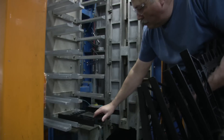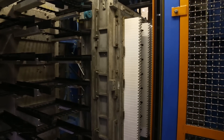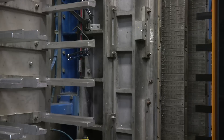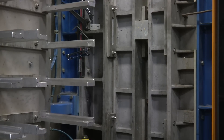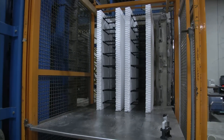The build block ICF webs are loaded into specially designed molds. The two pieces of this mold will lock together and the very light foam beads will flow into the mold. Hot steam is then pumped into the mold and the beads rapidly expand and stick together. After just a few moments, the mold separates and the finished block is pushed out.